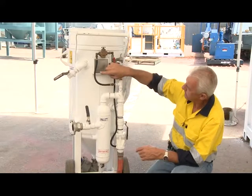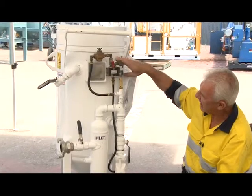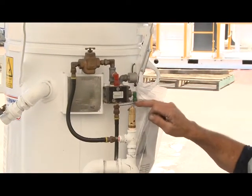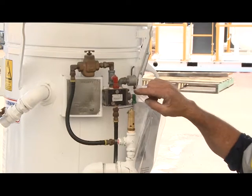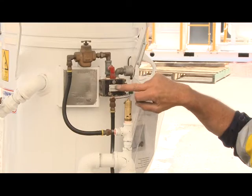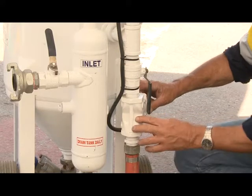The advantage of this pot here is that because it has a supply line going here through a pilot valve, this here is the signal aspect of the pot itself. So this is the primary activating valve. The quarter dead man line is attached here. The eighth dead man return line — the green one — is attached on the end. This pilot valve: when I open the dead man and complete a full circuit of air, this signal air goes down to the dead man and is returned through this one. This pushes the pilot valve piston across to enable a port to open. And that port, when open, will allow the air to travel down this hose all the way down to what is called an auto air valve.